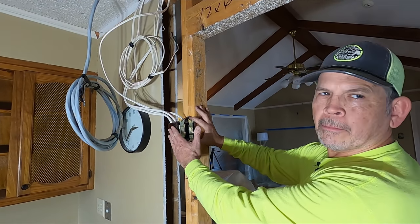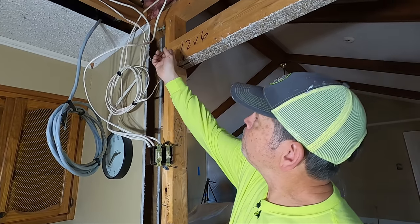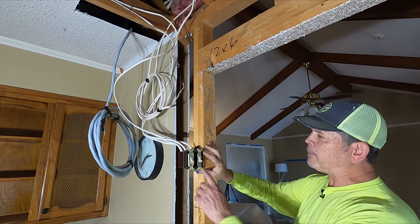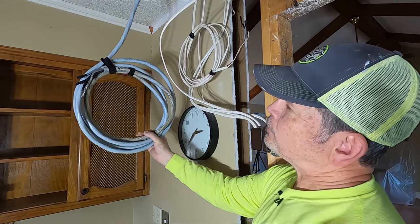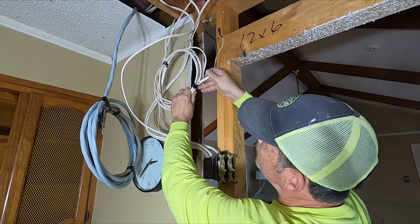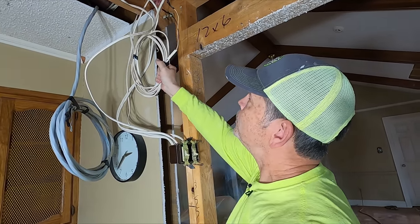So let's start right here on the electric. This double gang box right here serves the breakfast room and the kitchen. I disconnected all the wires, pulled them out of the double top plates, and came around and made up the switch again right here so the owners could still operate those switches. Hanging right here are circuits five and seven — that was for the old oven. This is aluminum wiring that'll be pulled out all the way back to the panel and we'll run new copper for the new oven. Circuit 10A — we labeled everything — is a 20-amp dedicated line for the old microwave, and we will certainly reuse that for the new kitchen.